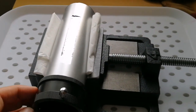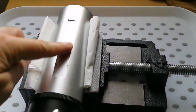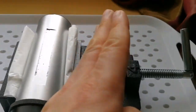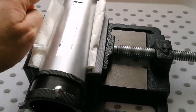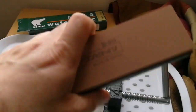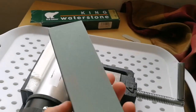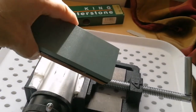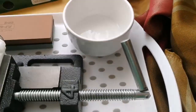I'll bring my tool to do some work on this surface to make it smoother. At the moment you can see this side engages but the middle part doesn't — it's like a valley, a cavity. I want to make it flat so the rolling wheel fully engages. For abrasion I'm using a King water stone, a very good quality Japanese stone. I'll make it moist and rub it against the surface keeping a flat, horizontal motion — not giving it a convex shape.